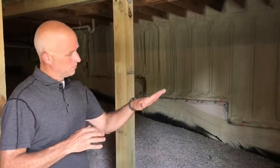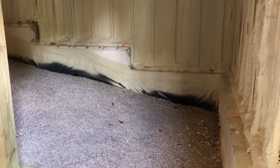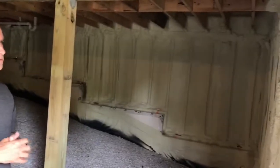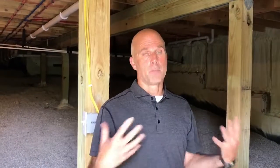Just below the spray foam on the walls is an insulated concrete form — the stem wall, or the short part of the wall that we are stacking the upper level walls on. The insulated concrete form allows us to provide an insulated foundation for the crawl space. From there up we've got frame walls that have closed cell foam insulation on them. So our crawl space is a dry, comfortable, cool place free of bugs, moisture, humidity and problems typically associated with crawl spaces. Proper crawl space construction is very important for the health, energy efficiency, and durability of a home.